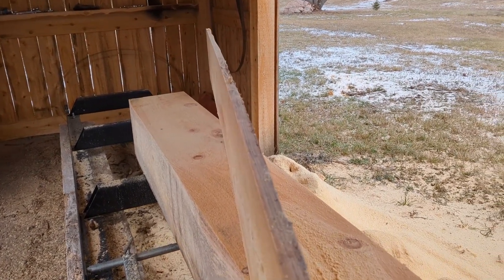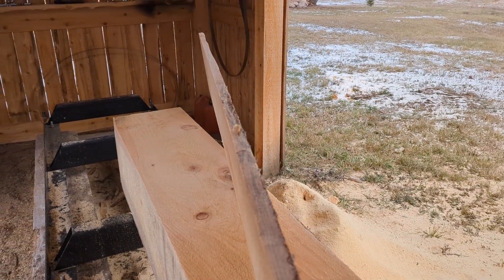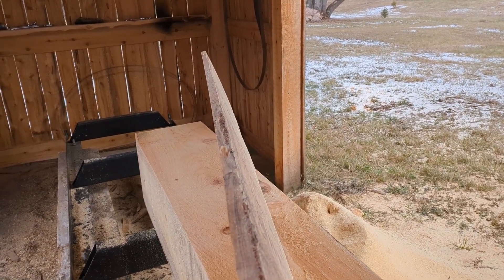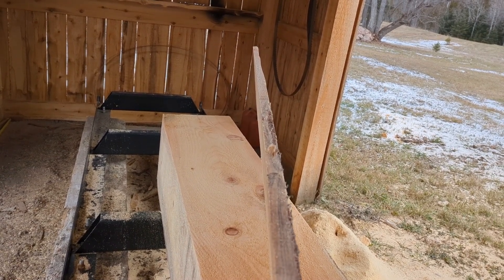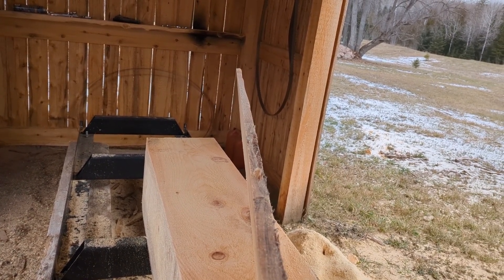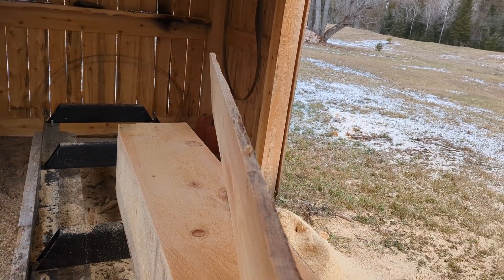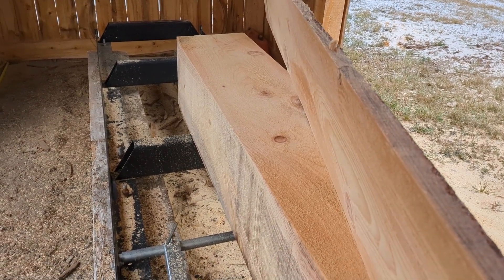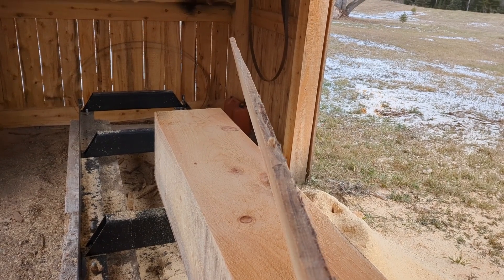You can see the waves on the right-hand side of this piece of wood I was cutting. Usually you get waves when you hit knots because it's a harder spot in the log. But I was just getting huge waves on soft pine. So I put a brand new blade on, and you can tell the difference — the new blade cut is on the left, dead straight, and the beat-up blade cut is on the right. It felt sharp to my fingernail test, but obviously it was not. A huge difference just with a brand new blade.